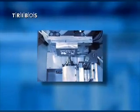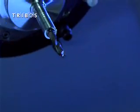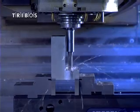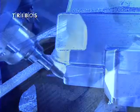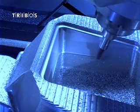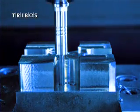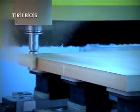Tribose R is suitable for high material removals and high volume machining. Tribose S is an extremely slim clamping system — the tool holder designed for cutting tasks where tool clearance is an issue. No other tool holder system is slimmer. Due to the symmetrical design, Tribose S can be used up to 100,000 RPMs. It meets the high demands in the mold and die making industry, eliminating the need for long, expensive special tools for drilling close to narrow contours. In the woodworking industry, where the focus is on rotational symmetry and stiffness at high speeds, Tribose has established itself in numerous applications.